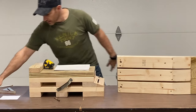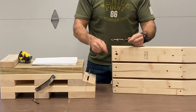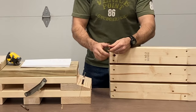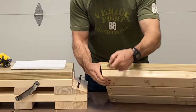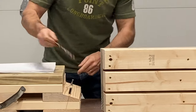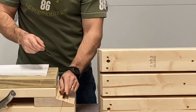I also took another drill bit that is bigger than the bolt or screw, so it makes it easy to get in there. And I marked that one with some tape right here, so I didn't drill down through this 2x4 too far. I just drilled into that 2x4 that far, which is a little bit further than that bolt sticks up. Here's the other end of the bolt that I cut off, and then I ground these edges down.